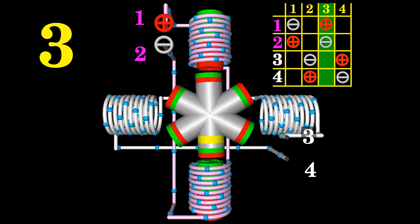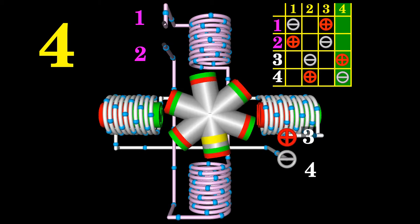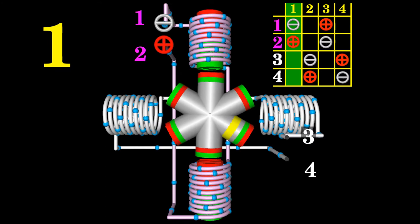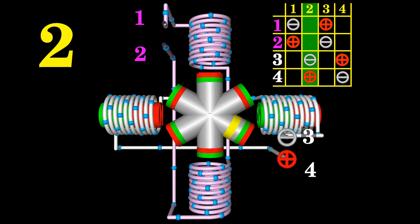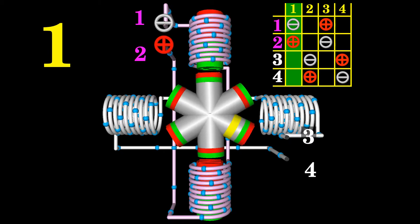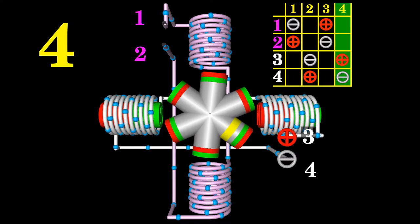The terminals of the motor are enabled using the sequence listed in the table that was also used to command the previous motor. Note that the motor turns counterclockwise when going from left to right through the columns of the table. With each step, the motor shaft rotates just 30 degrees. Consequently, after four steps the motor shaft has moved 120 degrees, which is just one third of the rotor movement done by the previous motor having two permanent magnets on its rotor. That's because the number of poles on the rotor is three times larger. Six steps are needed for a half turn of the rotor, thus 12 steps for a 360 degree turn. The rotational direction changes if you go from right to left through the columns of the table — now that motor spins clockwise.